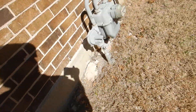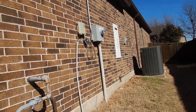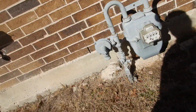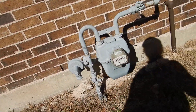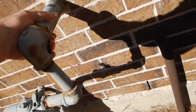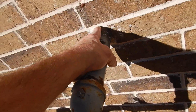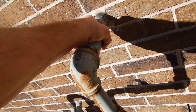There's some water coming into the house. I still don't see a main water shutoff valve. There's the water heater — we're going to have a whole water heater video about this. Over here on the south side of the house, this is where the gas enters the house. I don't see a bonding wire on this, and I'll tell you a secret — the bonding is not required, but it's probably going to be on the furnace.